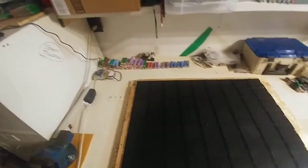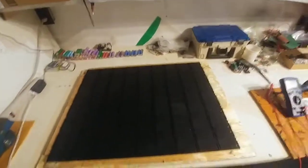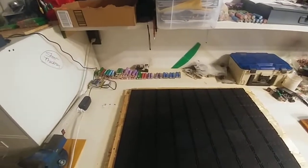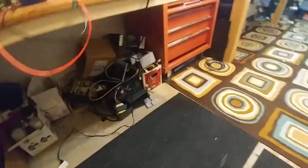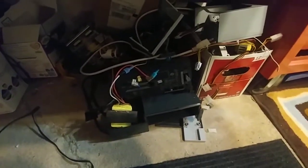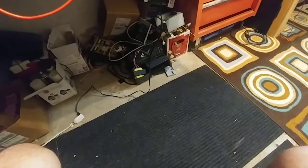You need like 200 amps for a spot welder, and my power wall can only do 40–50 amps, so maybe using super capacitors — but that's the same price as just buying a spot welder. I definitely have a full container of high-quality batteries in packs of two — these are all my really good ones, definitely enough to do an entire wall, which is awesome. And there's my old 24-volt inverter. The reason I never used it is because it's a modified sine wave UPS. It's junk.